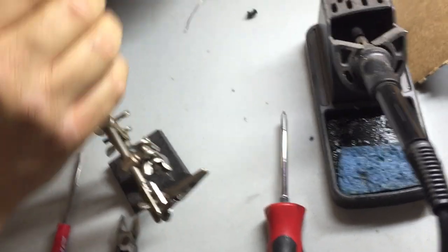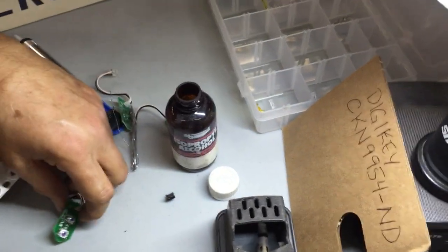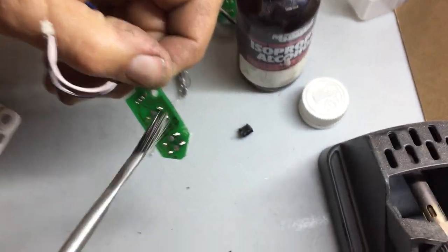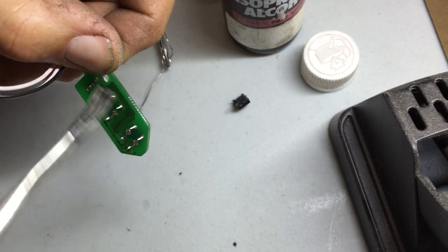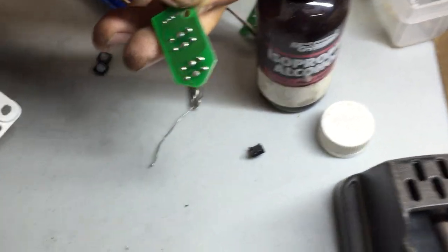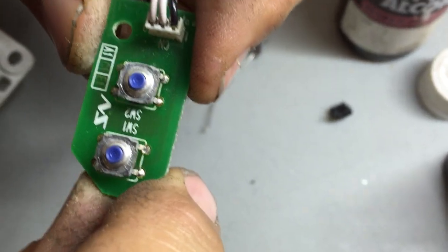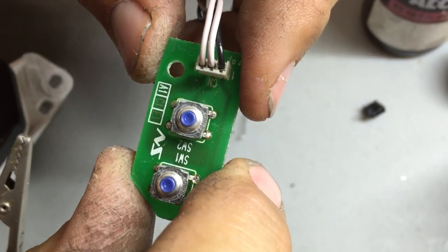So now these buttons are soldered in. The other thing that's really important when you're done soldering is that you take a little bit of isopropyl alcohol and you want to clean the solder joints on the backside to get the little bit of acidic stuff off of there to neutralize that. The isopropyl cuts the acid and it dries real fast so that you have good joints that will last a very long time. It'll air dry in just a matter of a minute or two. So now the buttons are replaced and soldered in with the new buttons, and we're going to go ahead and show the installation in the actual cluster.